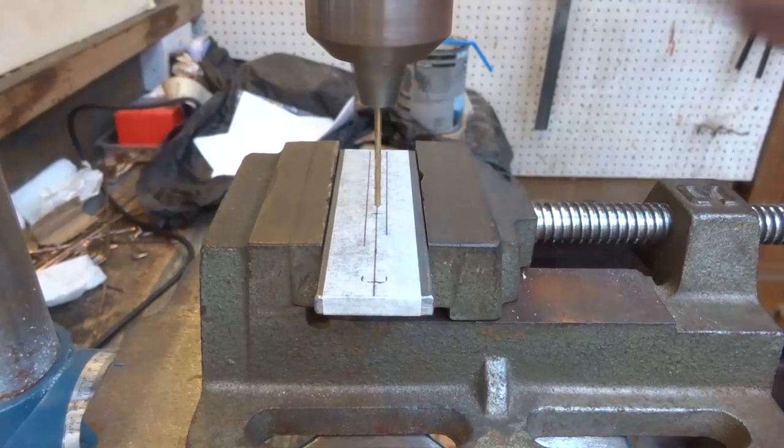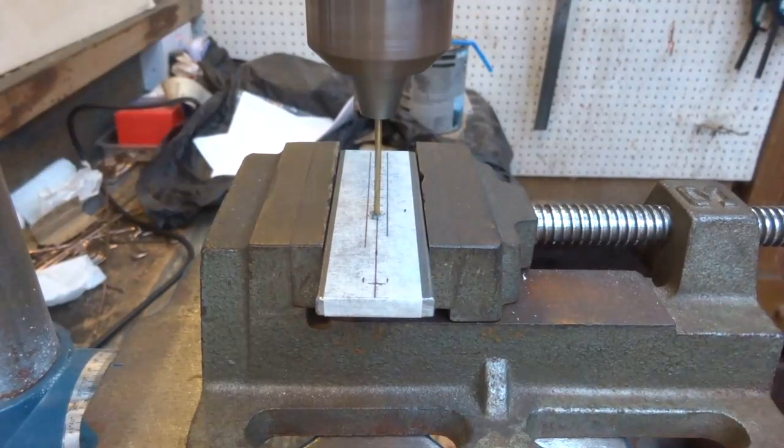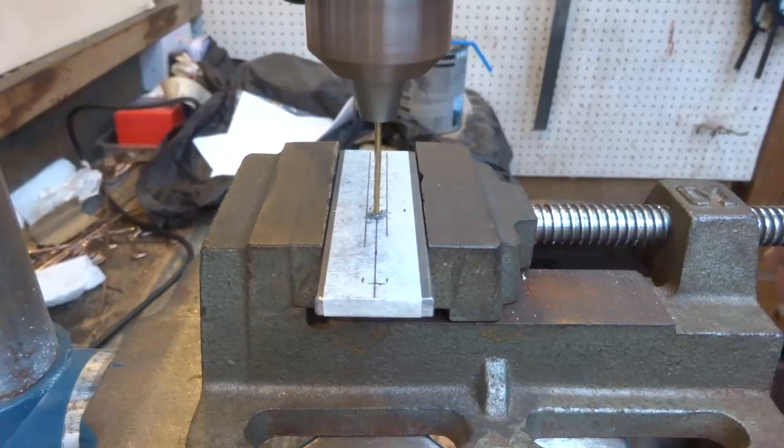Begin by drilling all the holes with a 2mm pilot drill. The small drill to start with will engage best with the centre punch indentation on the metal and give you the best accuracy in the finished product.